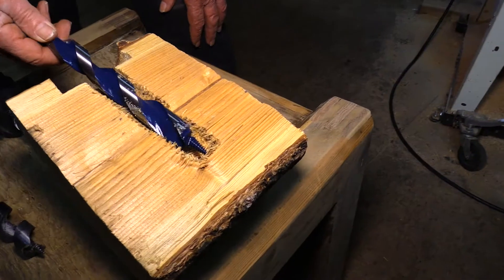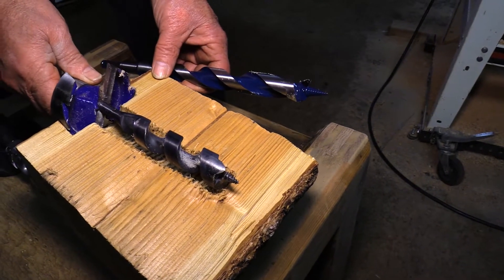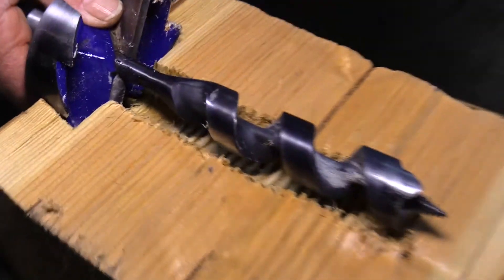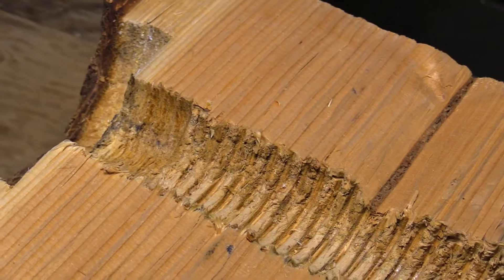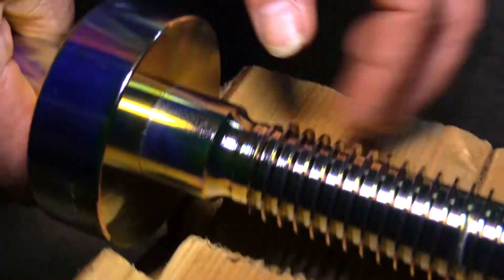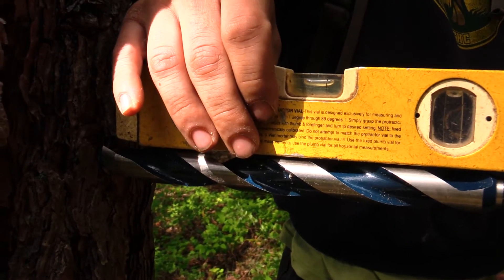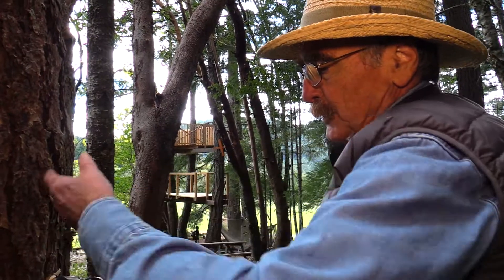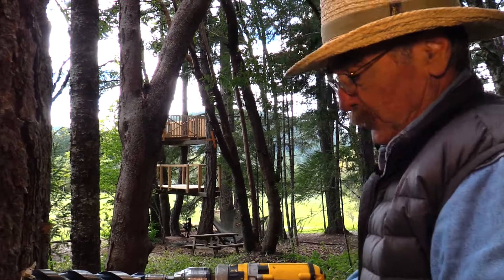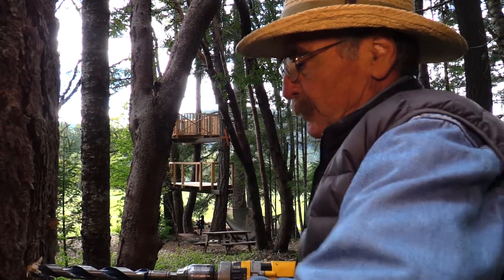This is another way of doing it — coming back with this bit. This one does not do the counter bore, but it will compress the wood. In softer woods, like pine, if you do it in a two-step with a one-inch first, you can probably do it with an 18-volt drill. But if you're in hardwood or doing all three stages at once, you need a bigger drill.